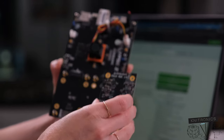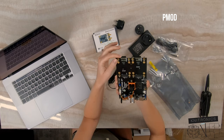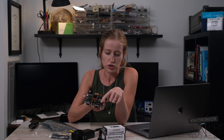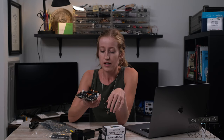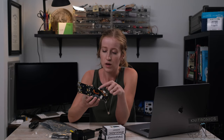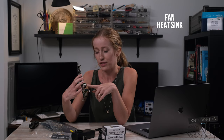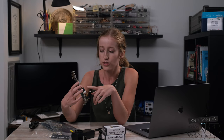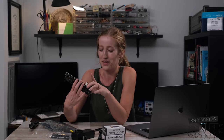You've got your two ZMOD slots, so you can have up to two of those connectors. You do still also have the PMOD, which is just a slightly slower version of the SYZYGY connectors. I'll leave a link to the SYZYGY standard so you can read up a little bit more on your own if you're not completely familiar with that. And then it's always awesome to have a fan — I love that there's a fan and heatsink included on the FPGA, because particularly with DSP-type applications or radio applications, this little guy can get kind of hot. I have definitely burned myself on other boards in the past.